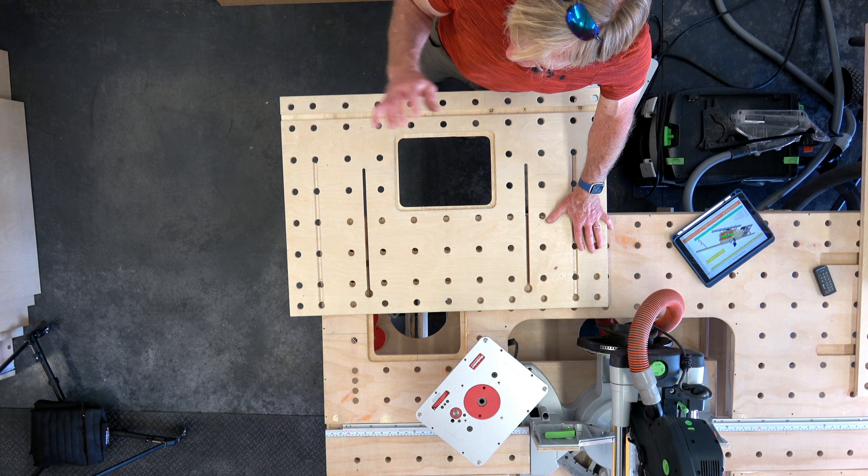I had a lot of things I wanted to accomplish with this design. I wanted to go with a bigger router fence — the Woodpecker that I have is about the same size but sticks out a lot further. I wanted to be able to use it on the Smart Total Station, which meant I needed to bring the router beyond the bench. My number one goal was to build it out of a single piece of 18mm plywood. I did not want it any thicker, any heavier, with stiffeners on the bottom, or anything protruding above or below the surface.